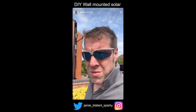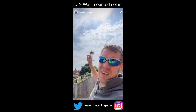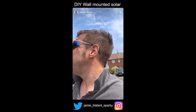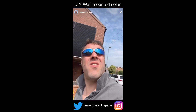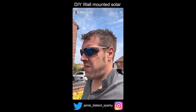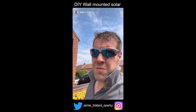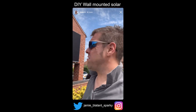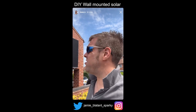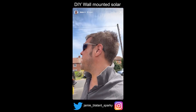Day one of solar - five panels. It's currently creating 730 watts and my battery is absolutely rammed. It'll be producing for another four hours at this rate. Normally we do all the washing at night on cheap economy 7 electricity, but we've got to change what we do now. I've told her to put the washing machine on because the battery's full and the solar's putting out almost a kilowatt. If we wait till tonight it'll cost us the cheapest rate; if we do it now it'll cost us absolutely nothing.